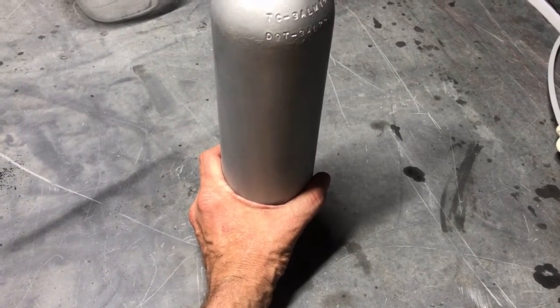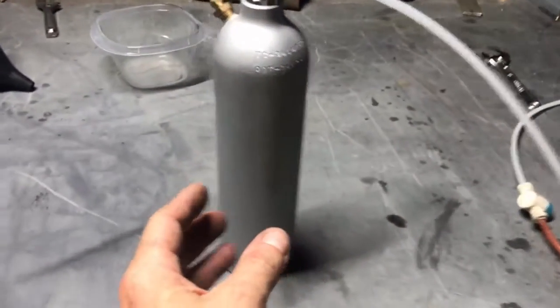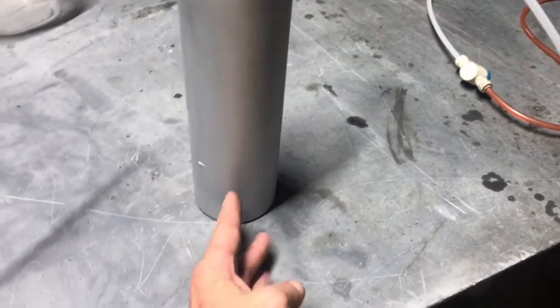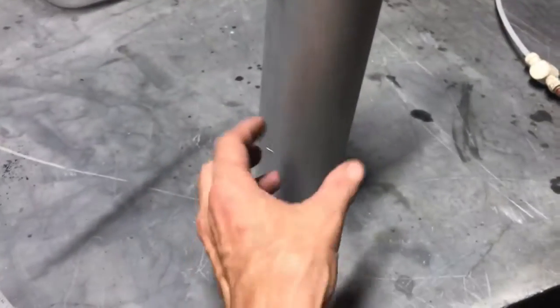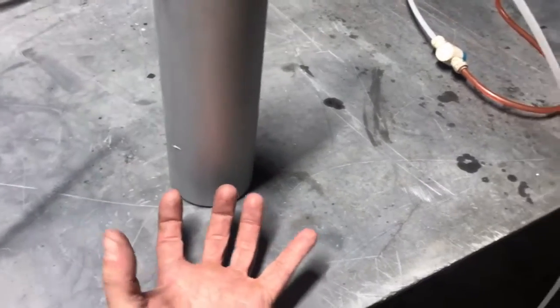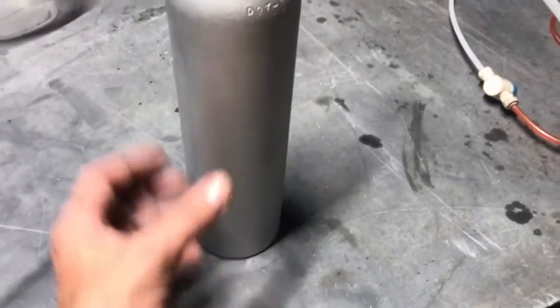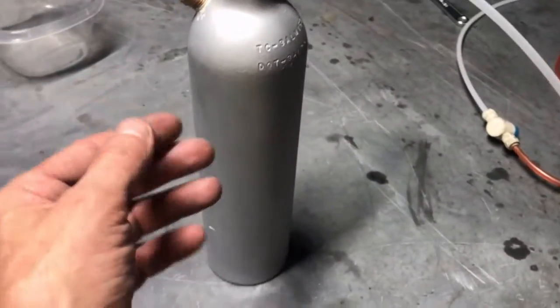When hydrogen diffuses into these materials, it tends to heat up as far as I know. I'm also curious about the diffusion behavior inside this tank — as far as the gas actually mixing. We may get some type of rat-holing effect, where gas bores a channel and just passes through an open channel rather than sieving through the material. So I may want to place some molecular sieve-type material at the very bottom of the tank, or try to turn this stuff into beads — maybe vitrify it. I wonder what we can do to it and still retain its hydrogen-absorbing characteristics.